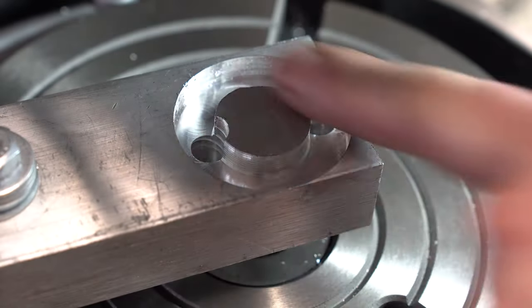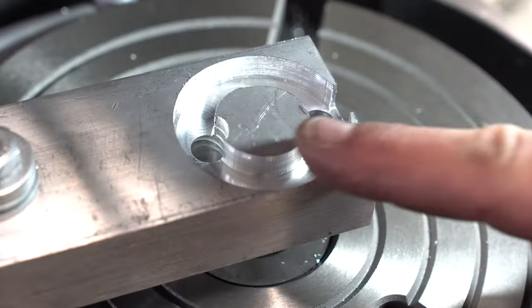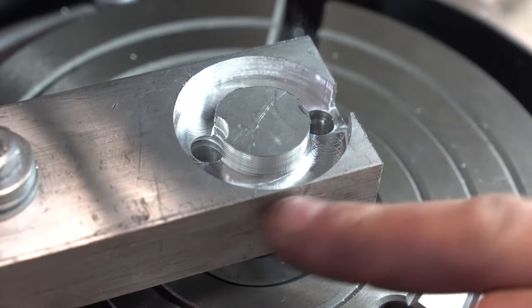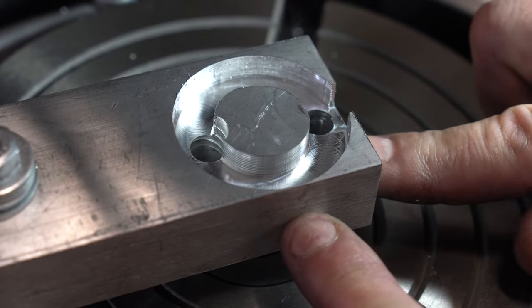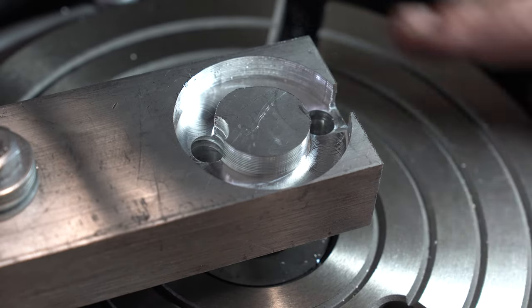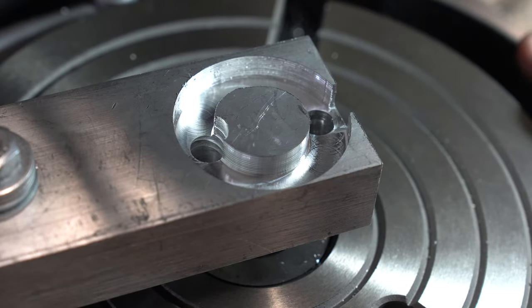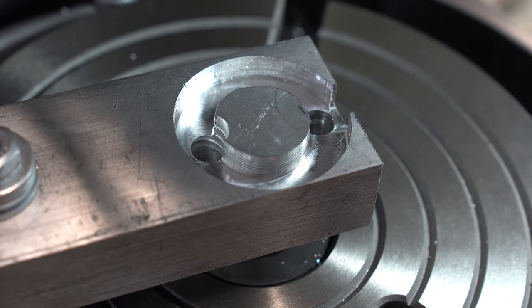That was pretty cool. I did this little circular channel in this piece of aluminum. Some would say you could do this on a lathe, but not in a piece like this — or if you wanted to do just half of an arc, you really couldn't do it on a lathe. Some cool things. I've got it right in the center of the rotary table; if I put it out further you can make different size arcs and some other really cool things. I'm no expert on machining and uses of this thing — I'm sure anyone watching who's a machinist can tell you all kinds of other uses for a rotary table. I'm a novice at the very best.